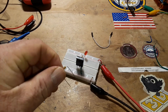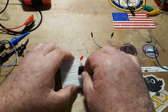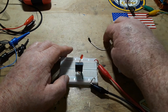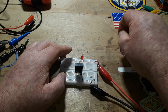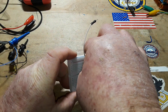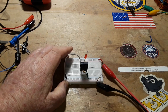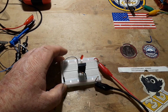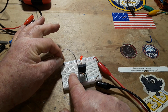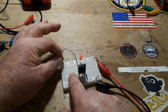Because of the insulated gate, I'm going to use a 10k gate resistor to pull that gate down. Now we'll plug our gate control wire back in and again start with the gate at ground, then energize the circuit. Circuit is energized when the gate is taken above ground — as soon as I pull this out it should go out. Yep — that's what we want.